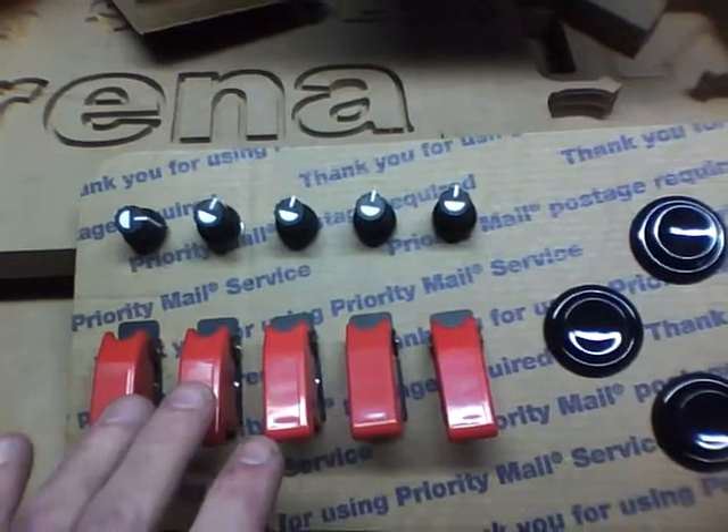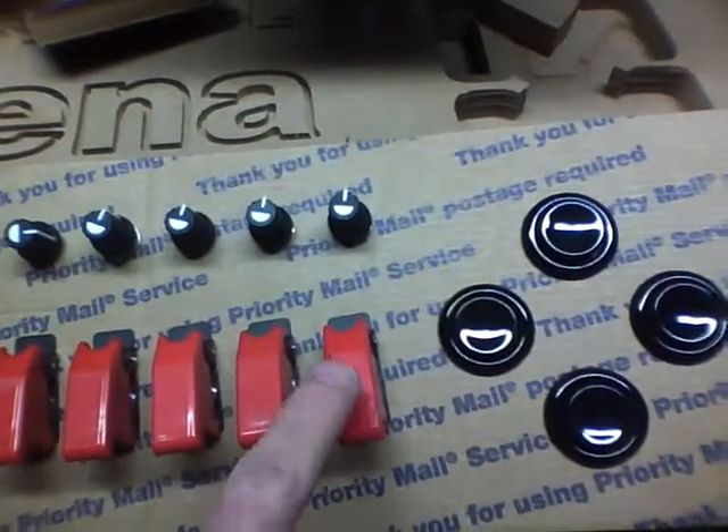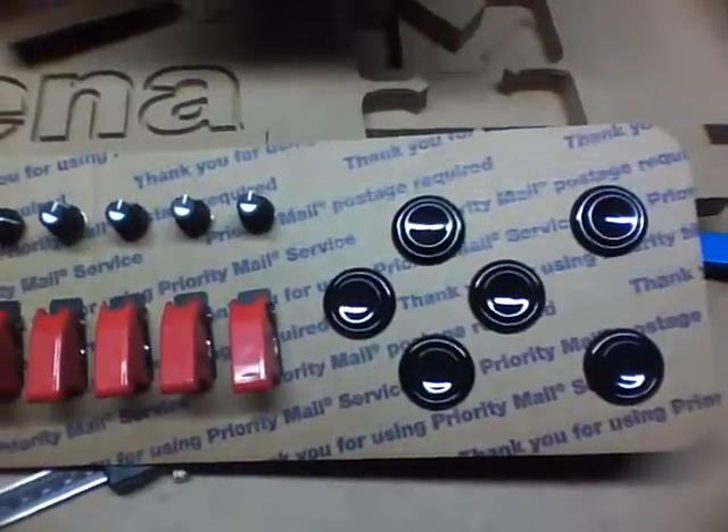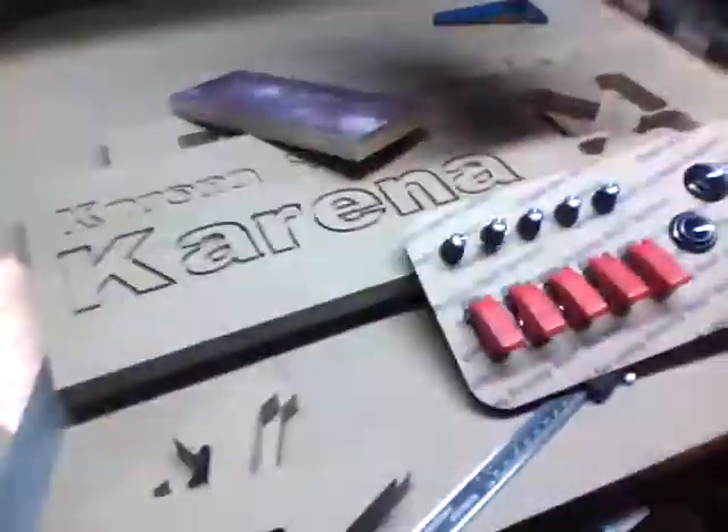Main on, router on, extruder, hot bed, and dust collection, probably. I'm actually probably going to have a couple LCDs. I started playing with my extruder — I got the little doodads in there, got the wires kind of shrink-wrapped and magic golden taped and up out of the way. I'm just now starting to work on the Arduino standalone controller to keep the temperature going. It looks like I'm actually going to do my 3D printing through Mach 3. I'm still going to have an Arduino on board and be able to switch to it, but it looks like I could just print directly from Mach 3, which I'm getting happier and happier with the more I use it.